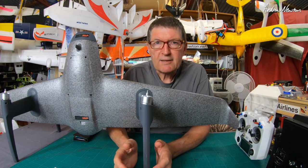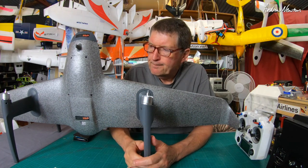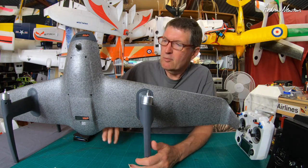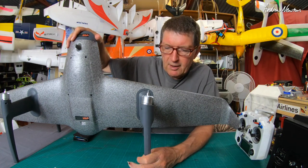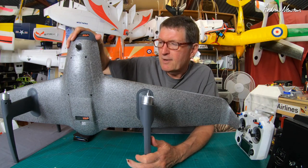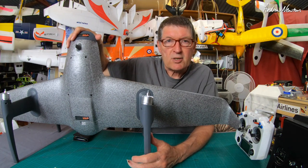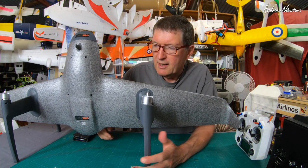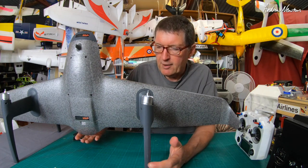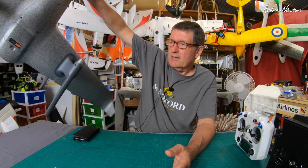It's based on the PX4, which is sort of a locked-down version of ArduPilot I suppose, but it should be set up to work from the factory and it just isn't. They've come out with new firmware and new parameters for me but that hasn't fixed anything. I did have a problem getting the GPS to lock into a home position in Australia — it just wouldn't shift from China even though I was getting 20 satellites. We fixed that with a few little tweaks, but I'm still not able to get it into wing mode, so it's an ongoing saga.